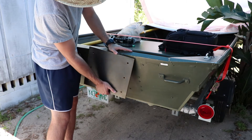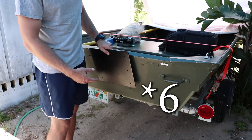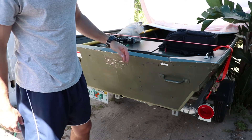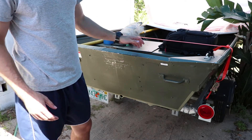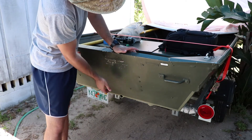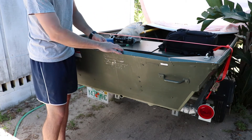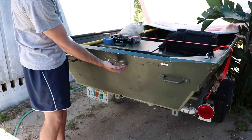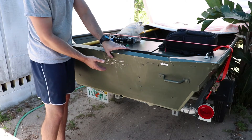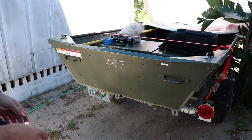And if that looks good, then we'll take it off, put Marine 5200 on this side and here, slap it up against there, tighten all four of those down, and then we'll have it all beefed up again. I got to get these two rivets out. Once we take those out, we can start drilling our holes going from the bottom upwards, because we're going to try to bring this metal that's bubbled out back up — this rail is bent down and there's a crease right here. We're going to try to fix that by bringing all this up and hopefully rounding it out.